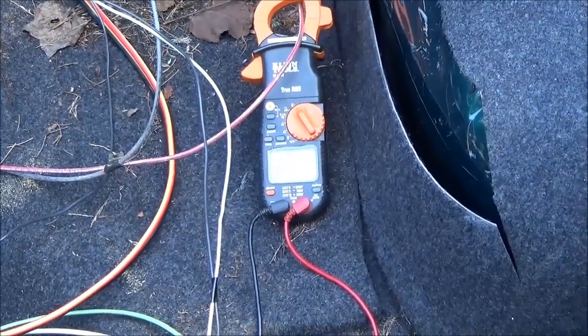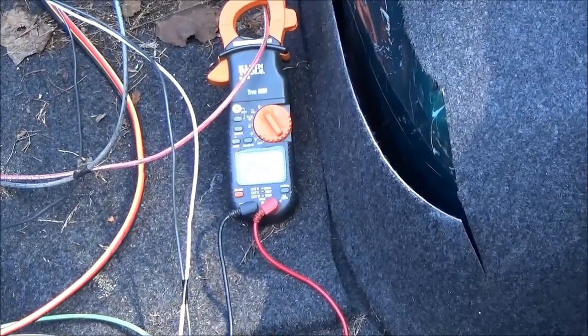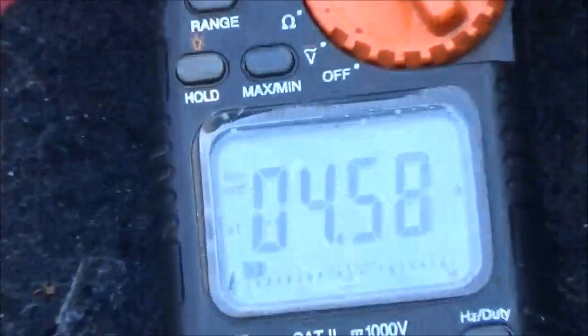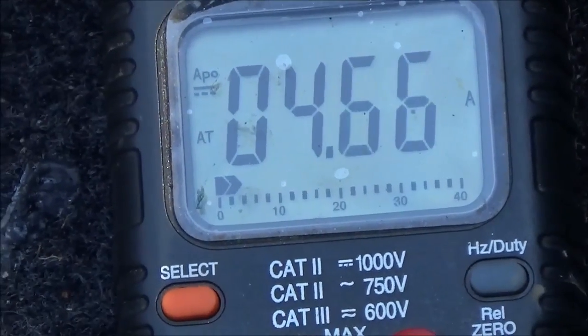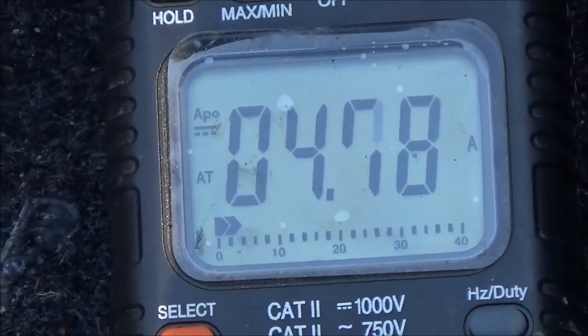Not a lot of power. I just don't think my voltage is high enough — we're at a place where the voltage isn't high enough in my opinion to push power into this battery bank. But the amperage should be dropping as the battery bank charges. We started a little over five and we're going down.